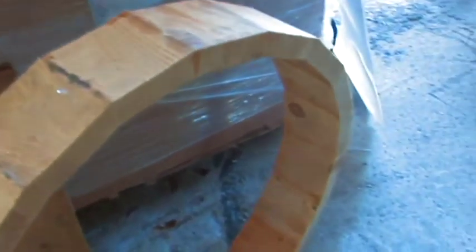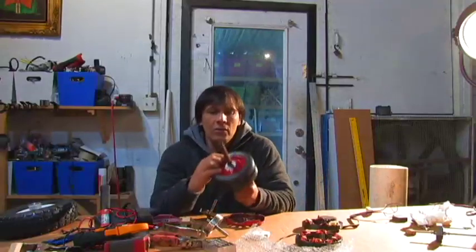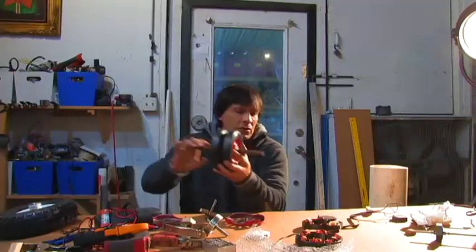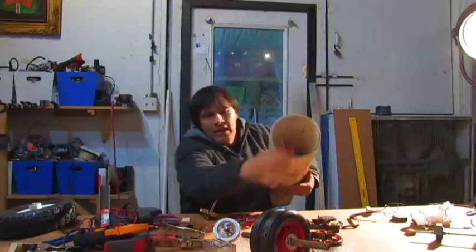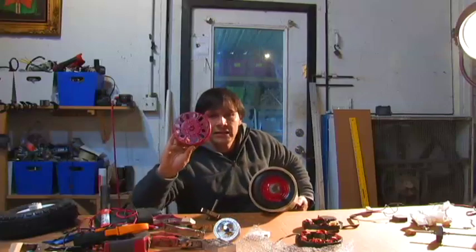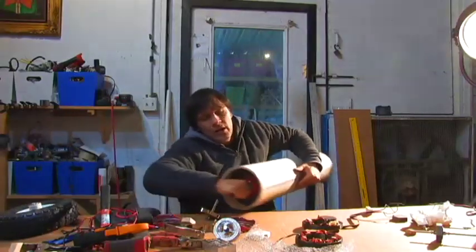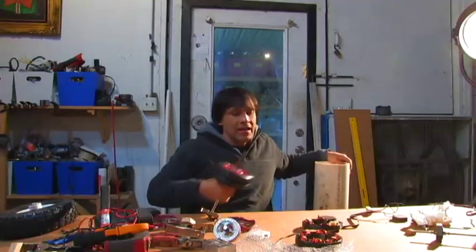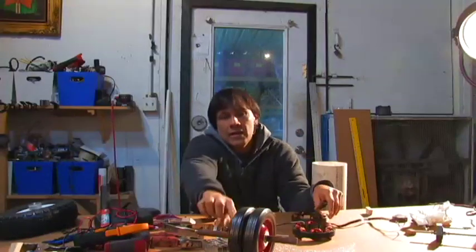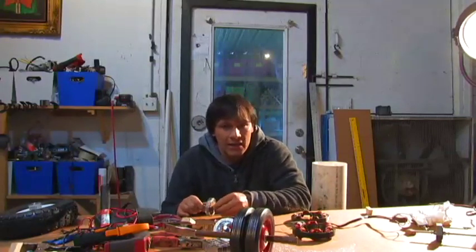This is a single piece of 2x6. I'm going to be using this technique to make barrels and also showing you how to use wheels like this with a wheelbarrow axle. These actually would go inside a piece of 6 inch PVC like this — they fit almost perfectly. Instead of using these, if you have a more powerful alternator that you want to make, you can use the PVC. It's going to give you waterproofing and you can offset them to make a two or three phase alternator. I'm your host Dan Rojas. Thank you for watching and enjoy our videos.